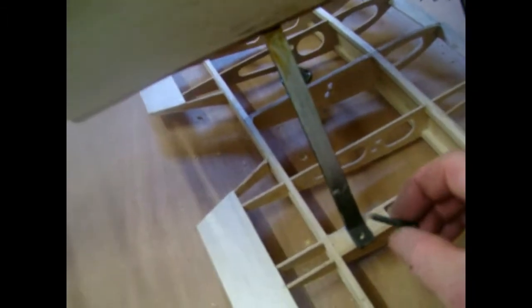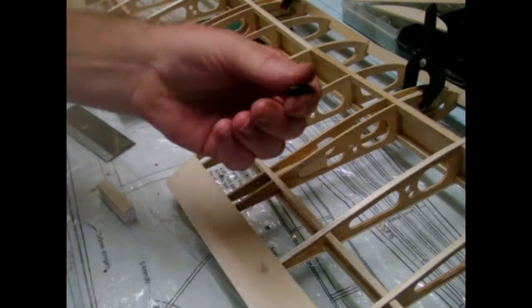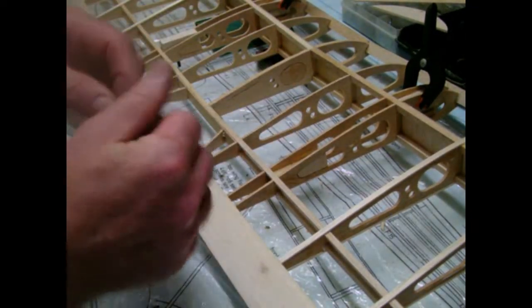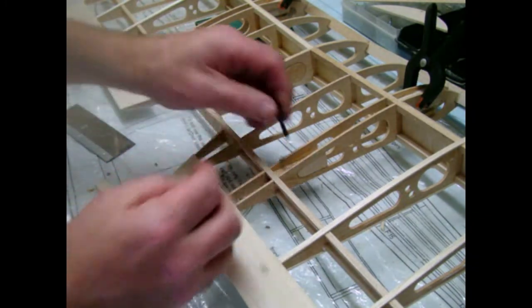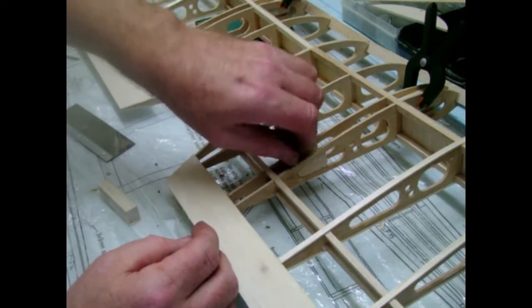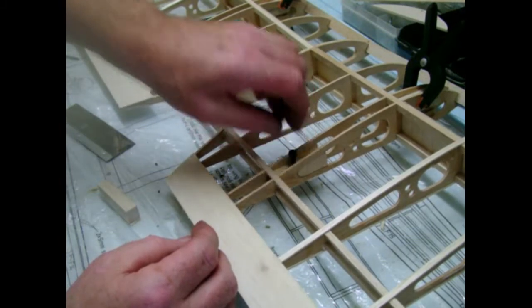And the next stage is to show how I'm going to keep these bolts in position with epoxy plus another bolt to tighten them up so they never come loose. Okay, this is how to do the bolt so it's in position. So here we go. You get your bolt, make sure, by the way, the bolts fit the nuts, because if you put one bolt in and it's cross-threaded, you've got a problem. So you put your bolt in so far, like that, so you don't catch the bottom of the thread when you put the epoxy on. So that's about there, I do.